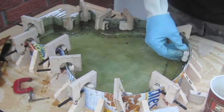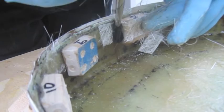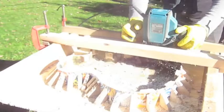I had to make special clamps to hold 15 wooden blocks that were set into the uncured fiberglass. After the fiberglass had cured the clamps were removed. A new layer of fiberglass encapsulates the blocks making them permanently part of the body. The purpose of these blocks is so I can attach the top of the body to the bottom using small screws.